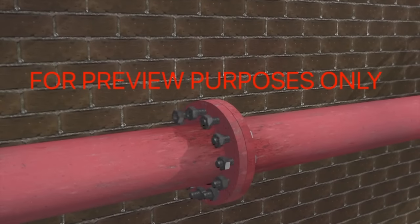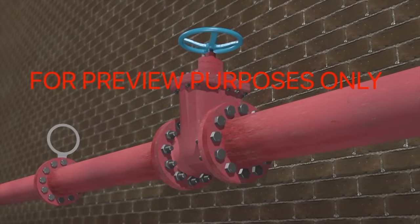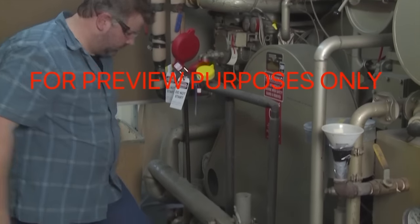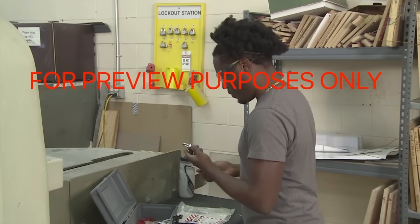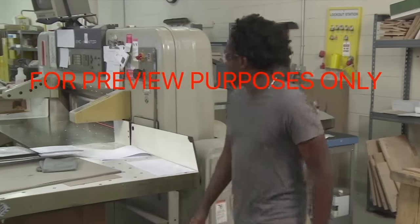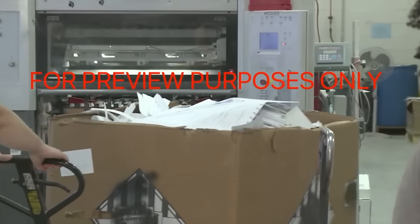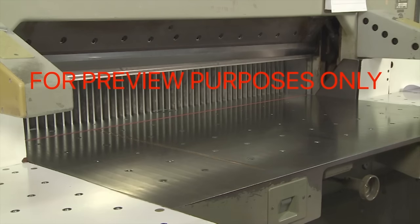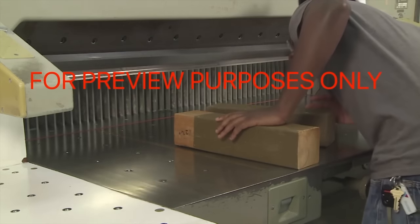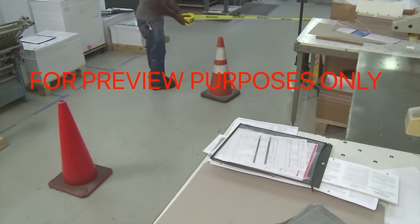Pipe dividers called blinds are useful when working with particularly complex hydraulic systems. Blinds enable you to segment the system and then bleed one section at a time, which provides the best protection in these situations. A good way to test the effectiveness of your lockout on hydraulic and pneumatic systems is to look for downstream valves that you can crack to see if any pressure still exists. There is one additional precaution for hydraulic or pneumatic equipment: these systems often include heavy moving parts that can be affected by vibrations from nearby vehicle traffic or other machine operations. Wedges, blocks, or pins can be used to secure these moving parts.